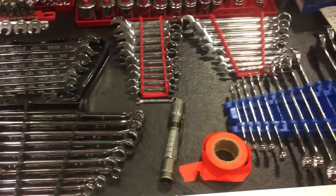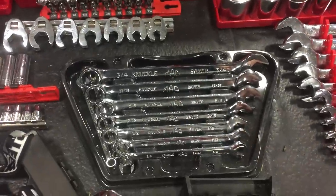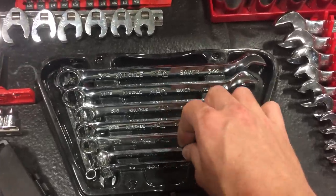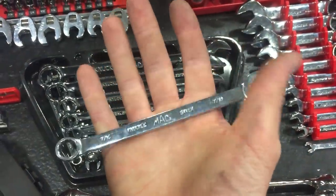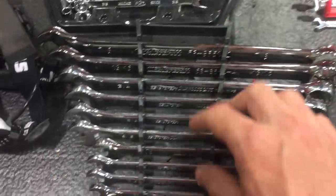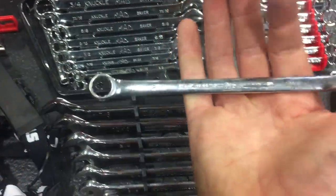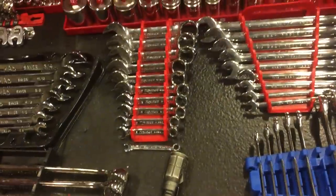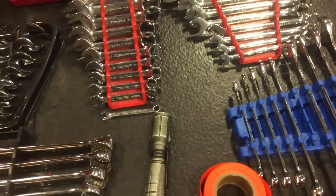As far as wrenches go, you don't need anything too fancy. Get yourself an assortment of different varying lengths. I only bought these because I got 50% off them back in college. You don't really need expensive wrenches like Snap-on flank drive — people are spending ridiculous money on wrenches as an aircraft mechanic, but the torques we're putting on 3/16 and quarter-inch bolts aren't enough to spread even cheap wrenches. These are Mastercraft from Canadian Tire and I paid like nothing for them and they work just fine. Get stubbies for sure, bonus points if you get a set with 11/32nds in it.